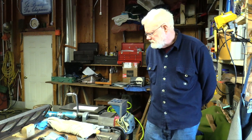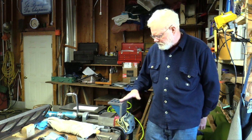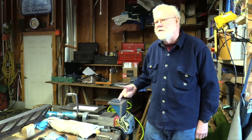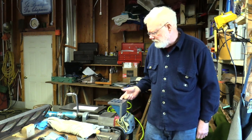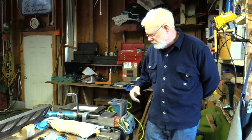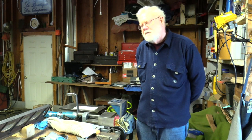Okay. And so what's your project? It's just an angle block, just to get it square and flat, and eventually I'm going to do the edges. I don't think that'll happen in this class, but I'm going to do the edges too, just as a practice. Where are you at? You got one side flat? One side is rough flat, the other one is pretty close to rough flat, so it's going to change to finishing pretty soon, I think. That's kind of that iteration like David was talking about. Get this close, go back to the first one, go back to the second one.